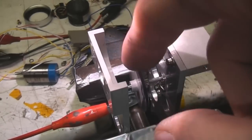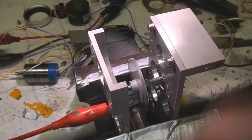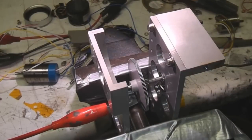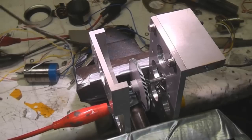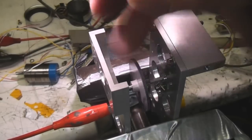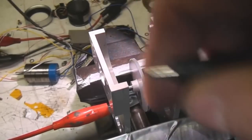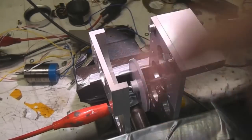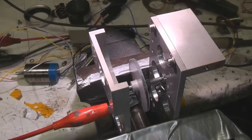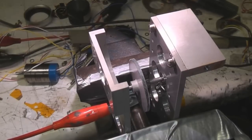So I've just got this shaft here, with a ball bearing each side. I've put it in the vice with some insulating tape over the jaw, so these 2 sides are insulated. With most ball bearings you need a good few amps to get going, but this is the second set of bearings on it. It trashes the bearings almost immediately, so don't do this with anything you actually want to keep. This one originally started at about 2 amps, but just for fun I'm going to crank this right up to about 5 amps and just see what happens.